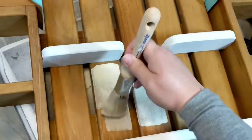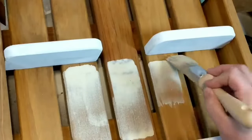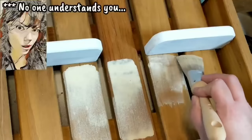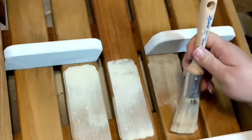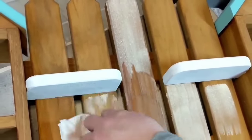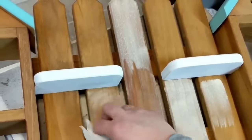And you want to make sure that whenever you do this technique, because it's like a whitewash, only it's not a whitewash. We're kind of doing like a stain, but it is a whitewash because I don't know how. Listen, it's like we created our own stain. We're going to go in with the brush. We're going to then wipe it back. And once it dries, you're not going to see it right off because right now it's just going to kind of look like a mess.